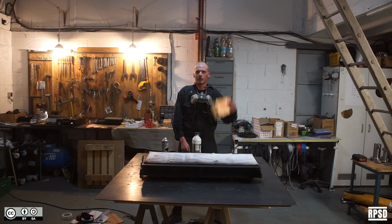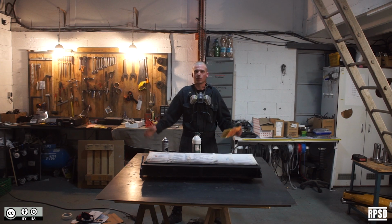And again, we're going to stick a small round sticker over each of the M5 and M3 bolt holes to protect them from being painted. This is for electrical grounding and ensures that all the panels are connected to the frame.